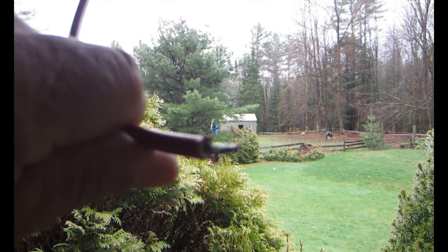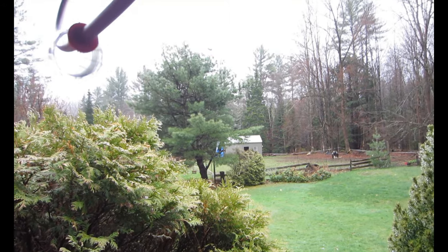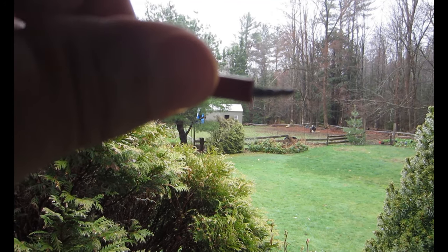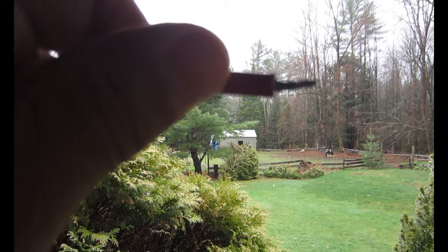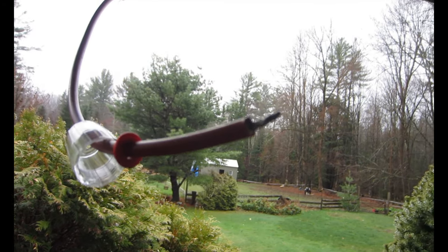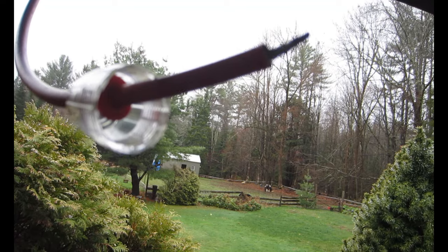First, strip the wire that comes in from the solar panel — this is 10 gauge wire, the positive lead. You want to make sure you cover up the panel so it's not taking any electricity, as a safety measure against shock. I pre-put the rubber gasket and the barrel protector that goes over one end of the circuit breaker on the wire. The fat side of the gasket faces down, wide side, and we're going to strip that wire about a quarter of an inch on the end.